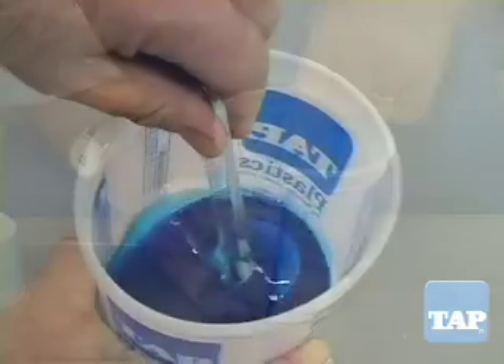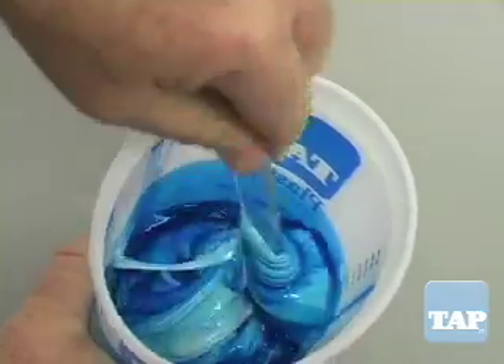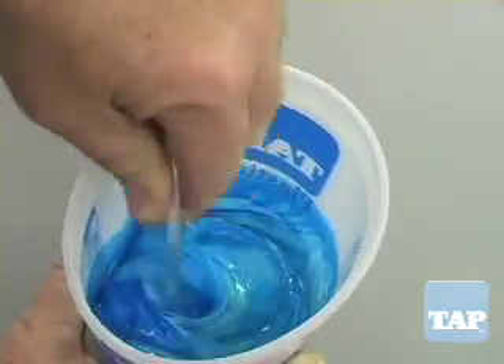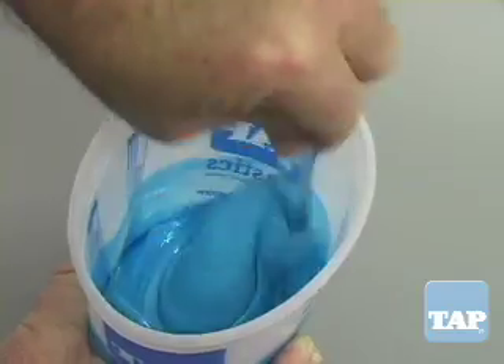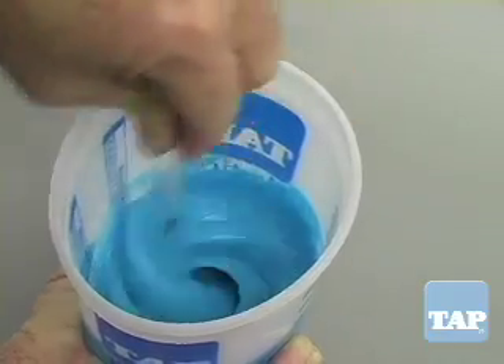As you can see, it is a challenge to mix a very thick and a very thin liquid together. Fortunately, the hardener is dyed blue to help us see when the mix is complete. Incomplete mixing will result in incomplete curing. And unlike cured silicone, uncured silicone is very difficult to remove from the part, so great care is required in order to produce a thorough mix.